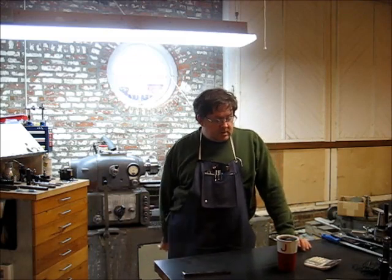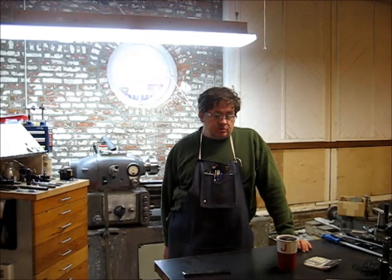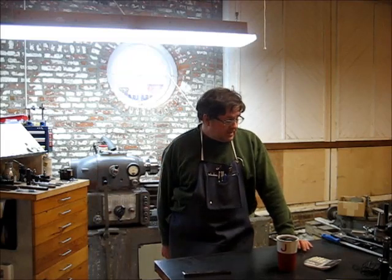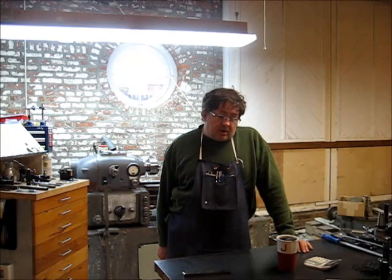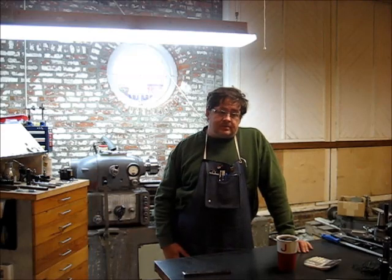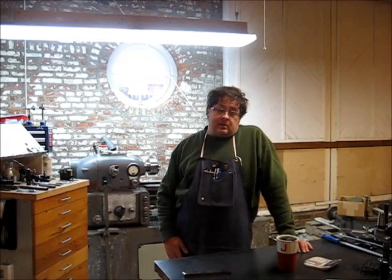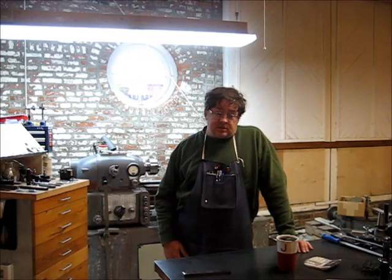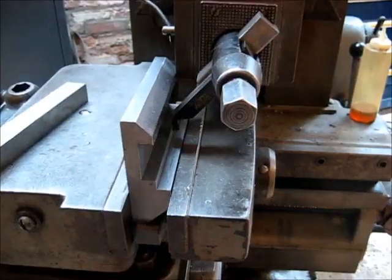We're gonna finish up the Bandsaw Vice shoe, the add-on shoe to the Bandsaw Vice, in today's episode. We're not gonna do it quite the way I thought I was gonna do it. Spent quite a bit of time grinding out a cutting bit to do the T-slots in the shaper, only to find out that I should use a slightly longer piece of tool steel stock to grind it, and it's not long enough, it doesn't give me enough reach, and I'm going to show you why here, and then we'll talk about alternatives.